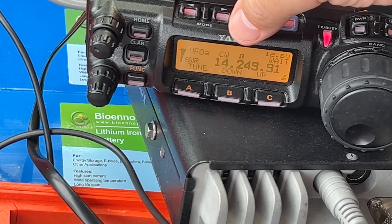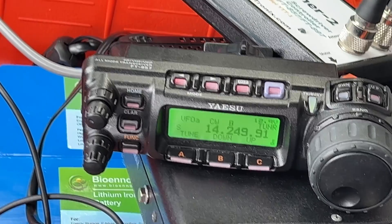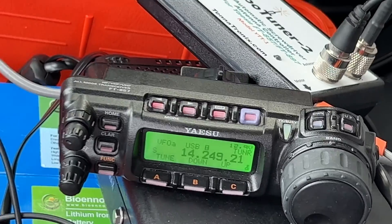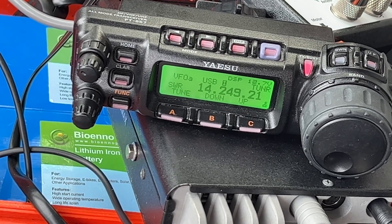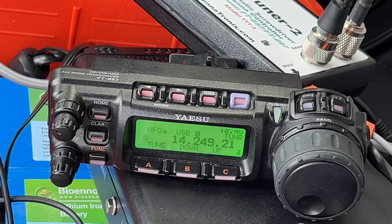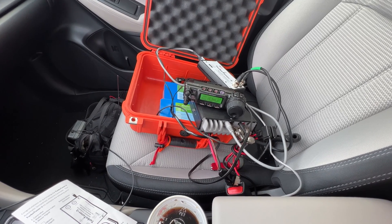It's orange and red, meaning it's high SWR, and it's doing something — I can hear it — and it's green now! Look at that, SWR is green — that is incredible. I go to upper sideband, still at 10 watts. Is anyone on this frequency? The meter right here did not go anywhere and it says we're tuned. That is really cool. I was not expecting this thing to work that efficiently — I'm impressed, I really like this unit.